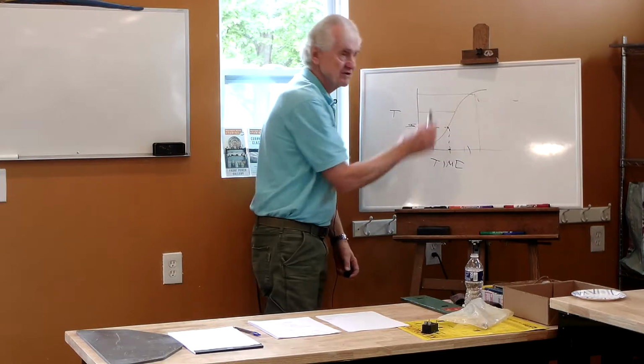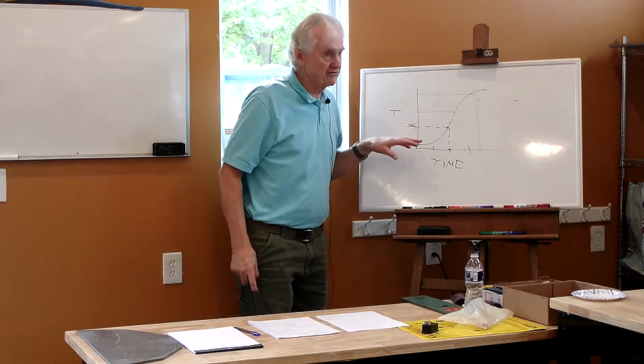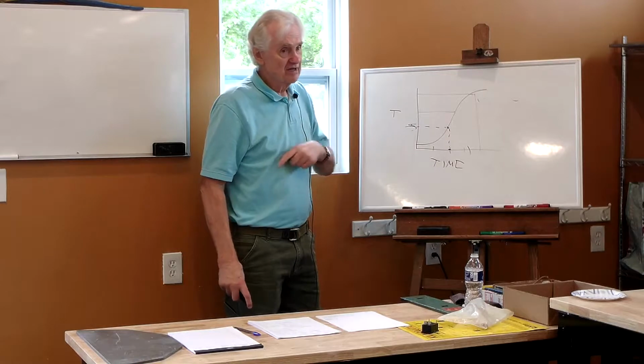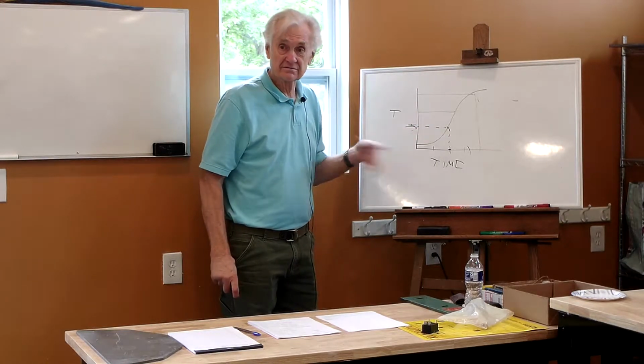What time, what temperature am I? That's the way they work. And so an important part of these electronic controllers: if your temperature measuring device, your thermocouple, isn't working properly, the controller is useless. It's blind, basically. And it will go to error.